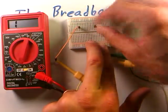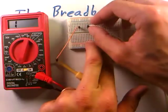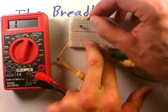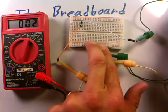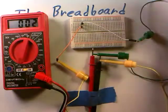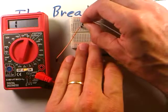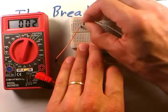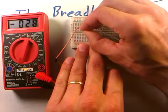If I take this wire and put it over into another column, still no connection. Another column — still no connection. But now if I take this wire and stick it into the same column as one of the other wires, then there you go. You see the resistance on the meter suddenly drop, indicating a very low resistance between these two points — the breadboard has these two points interconnected. I can put it on any hole in this column and all the interconnects work out.